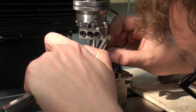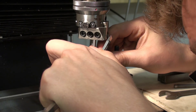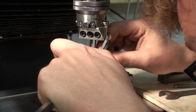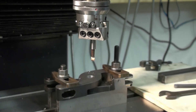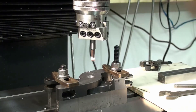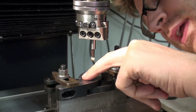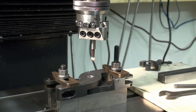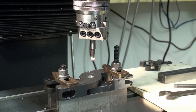So let's take a first rough measurement. We grab 12.98 millimeters. So we can't bore this to 13 millimeters because there's just not enough material — we make full contact on this side but barely on that side. So let's aim for 13.5 millimeters.